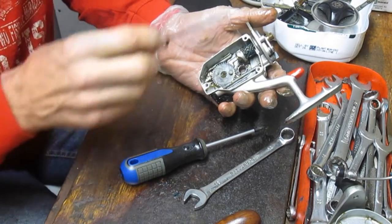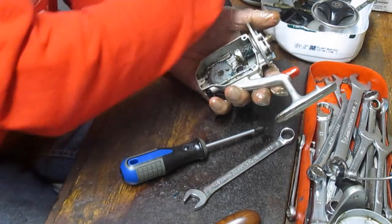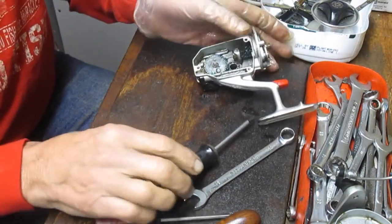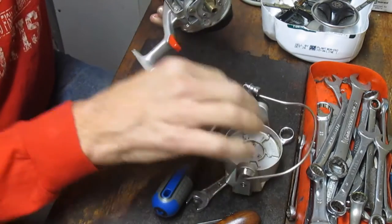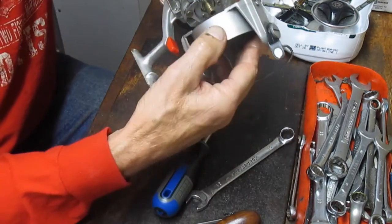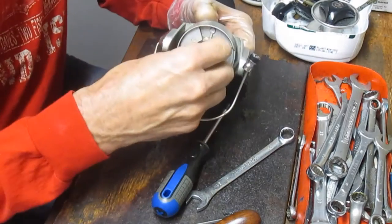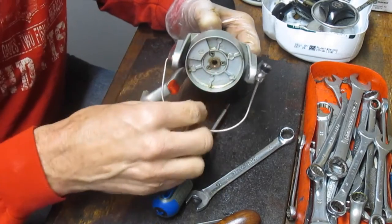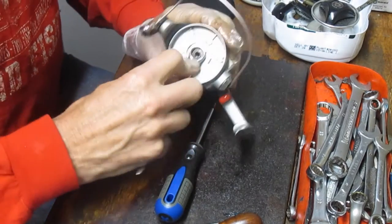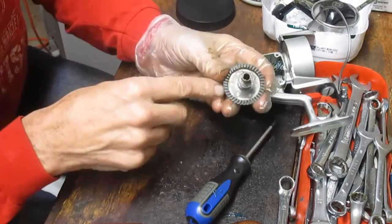Now we're going to put a little bit of grease onto the teeth of the main gear, and also a little on the face because the crosswind block is going to ride on that face. That's all — you don't need to overload these with grease. Back to reinstalling the rotor — sometimes you're not going to be able to grab the top of the rotor because there's play in the pinion gear. In that case, hold the pinion gear up so you have enough play to get this down, then put this back on and tighten it with the 12 millimeter wrench. Give it a spin to make sure it's spinning properly.